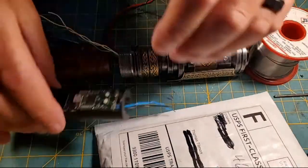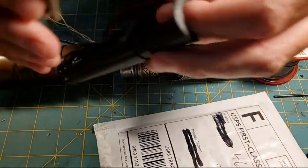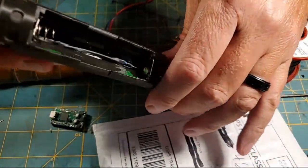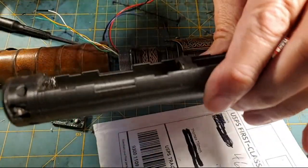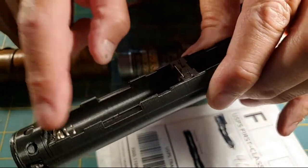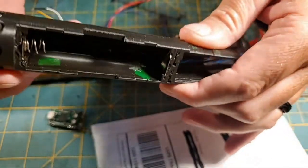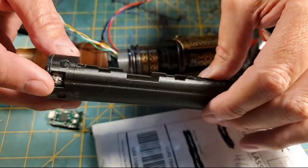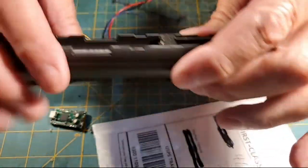So this is the new chassis we're going with. We're actually going to reuse the Proffieboard 1.5. For time's sake, I did some pre-building. I soldered the negative wire to the spring side, your negative. And then I soldered up the two contacts for the speaker, and I ran the speaker and the speaker wires.